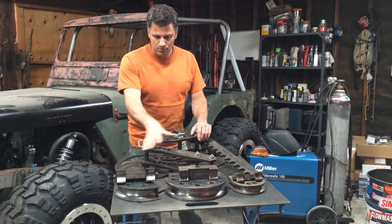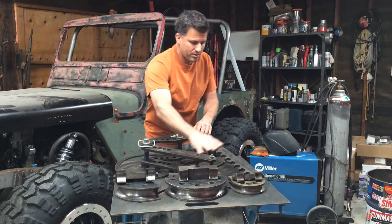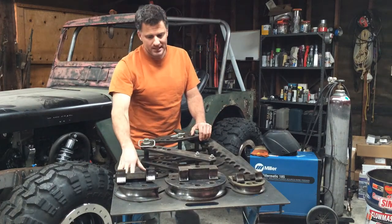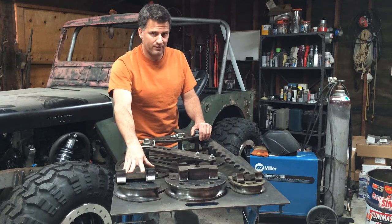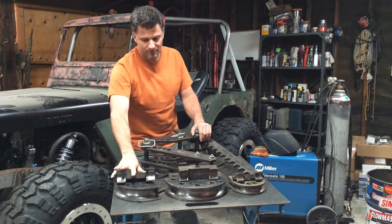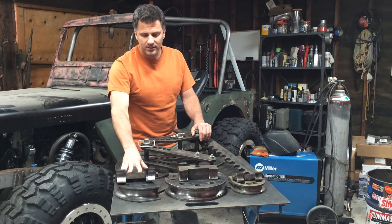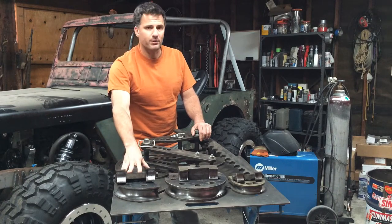I like to use three different dies. I have an inch and three quarter, one and a half inch, and a one inch die. The inch and three quarter die I only have as a 90-degree die, because typically I'll use this for things like roll cages inside a full-size truck or a roll cage in an open top Jeep — inch and three quarter is great for that. You can also build bumpers and things like that. I usually don't need 180 degrees for those bends, so I save a little money by going with the 90-degree die.